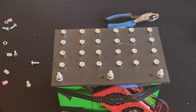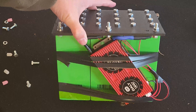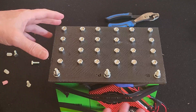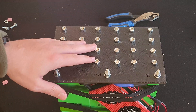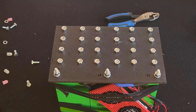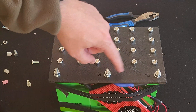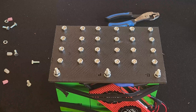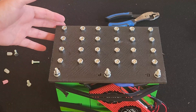The pack is complete with the BMS hooked up and balance leads connected. It's not the prettiest, but the 3D printed top hides all the BMS leads underneath. The terminals are all energized, so I'll probably hot glue every terminal or add a plastic sheet to insulate. We've got B-minus and P-minus clearly accessible — use those two posts to go straight off the battery, or the other two posts to go through the BMS. Now let's get it in the battery box and do a capacity test.